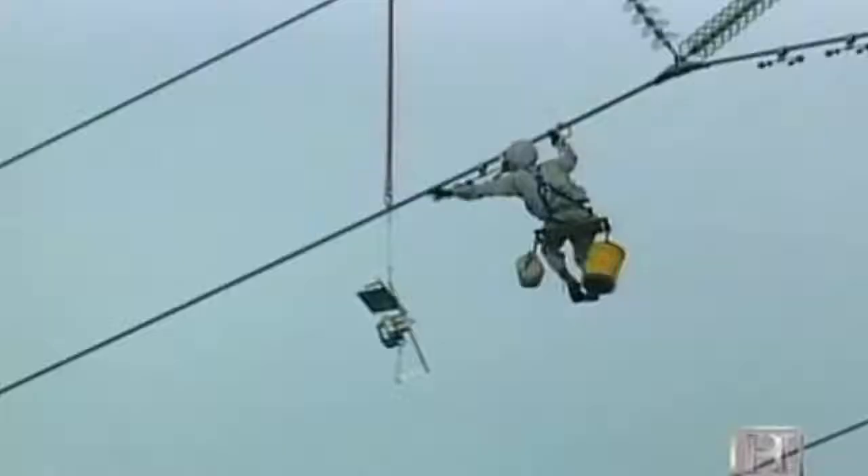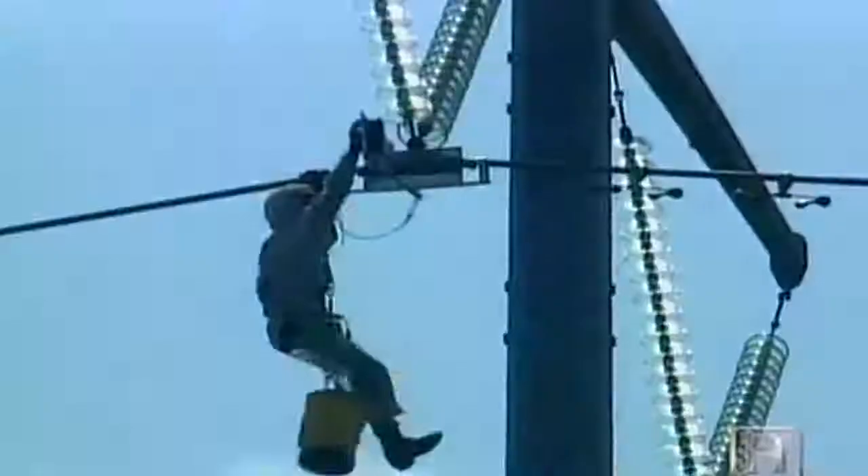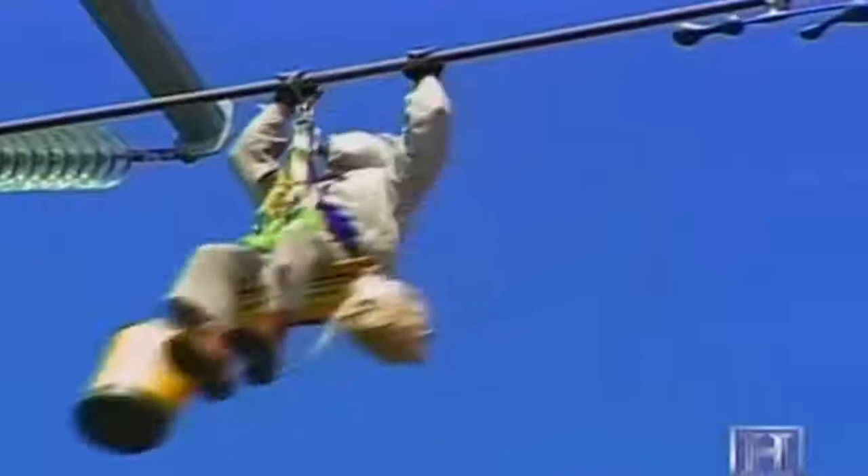When you get close, you just gotta be like Gumby — flexible and stretchy — get your foot on it, get your hand on it, just get on it any way you can. Brandon uses a digital X-ray camera to examine the line behind the shoe — the support from the tower that holds the wire in the air, the greatest stress point on a high-voltage wire. You hook it on the wire, keep it level, slide it back, push a button, then slide away about 10 feet to avoid the radiation before it shoots.